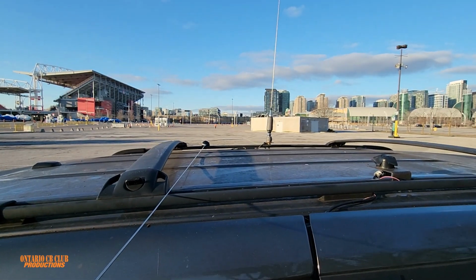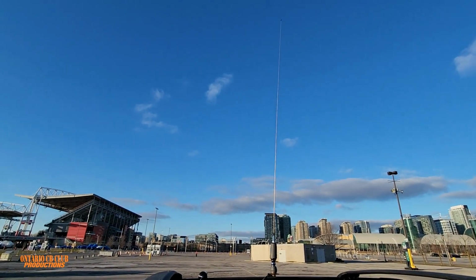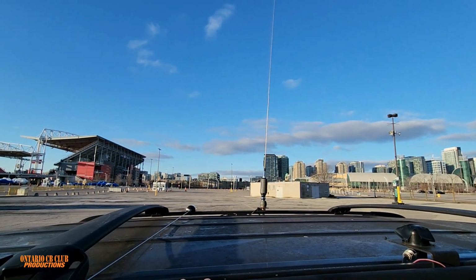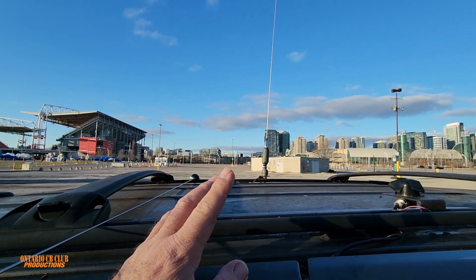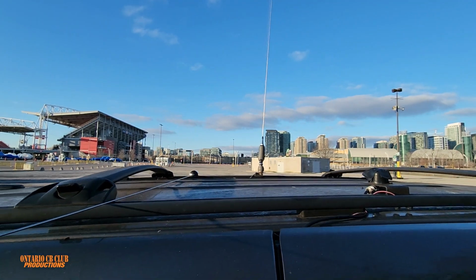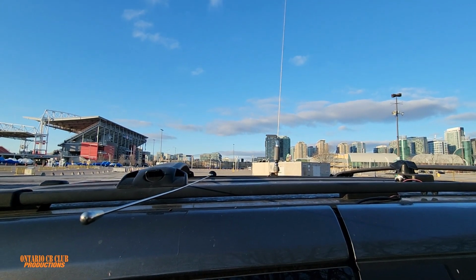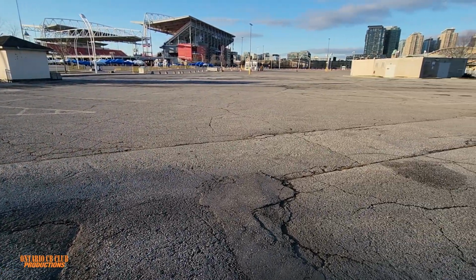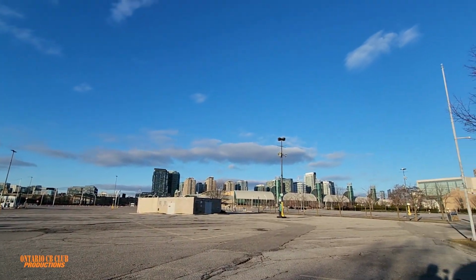The reason that I don't want to buy a used mobile antenna, look at the Sirio here, look how tall it is. I know these antennas are made for this band, so you might not have to cut them, but in the case that somebody cut it to tune it and match it to a specific area in the vehicle, and the whip is too short, then it's not gonna work with yours. It will not work with the location that you want to put the antenna. So that might be an issue.